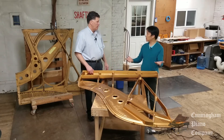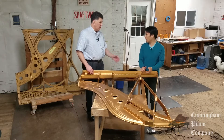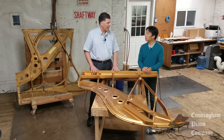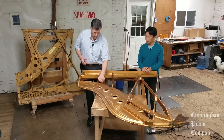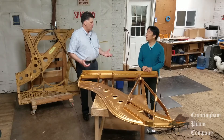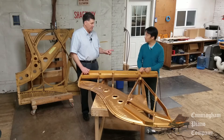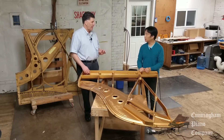Why iron as opposed to some other metal — why not steel? Steel certainly is strong enough, isn't it? It's actually stronger than iron. But steel has resonant frequencies that would not agree with a piano. One of the nice things about cast iron is it gives us lots of power and it never gets in our way tonally. There's a resonant frequency, but there isn't a pitch. So it's not going to vibrate sympathetically with the strings and add extra buzzes, noises, or rings. If that does happen, the frame most likely has a flaw in it, and that does occasionally happen.